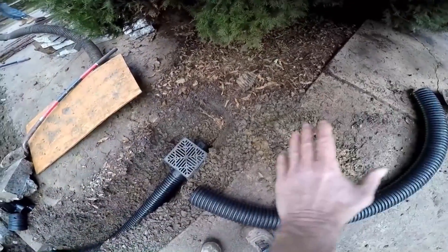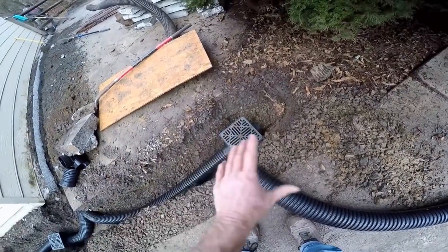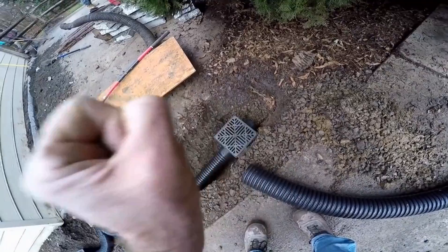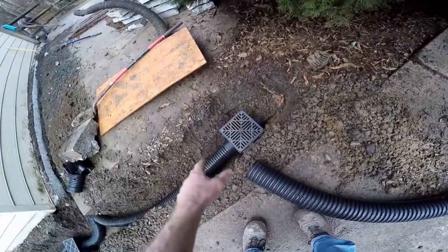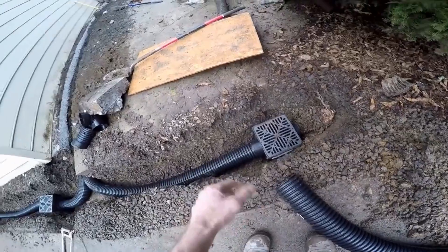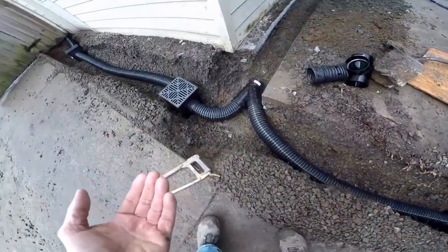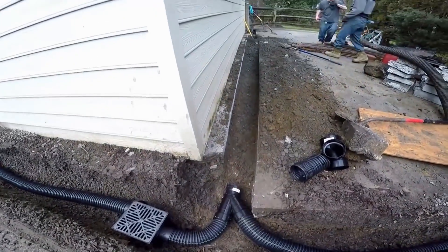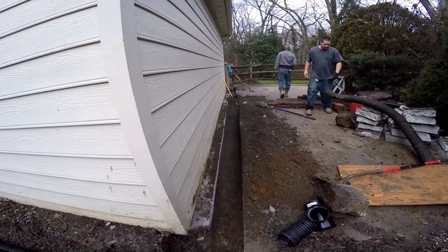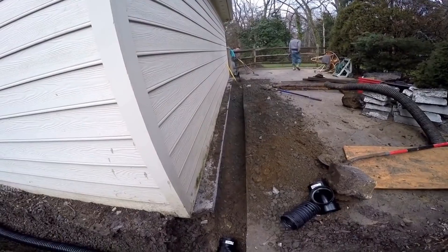Water is coming off the driveway, drops into the catch basins. Remember, this is also gravel — gravel acts just like a catch basin or a channel drain. There are voids in the gravel and water drops right through it, going down to the bottom of the pipe. At the bottom of the pipe, there are holes that allow the water to flood up into your system. We're going all the way over there through this walk, and we're also going to add a drain right there in the center to help pick up any water missed by the system.